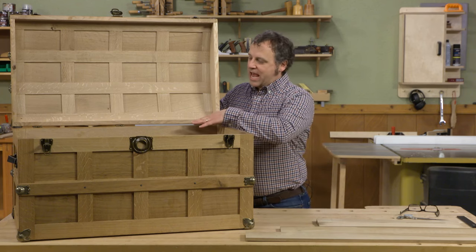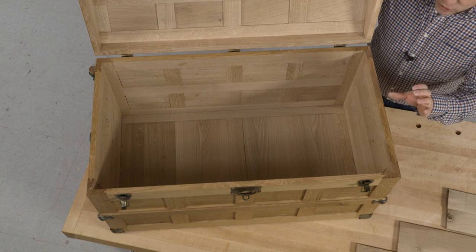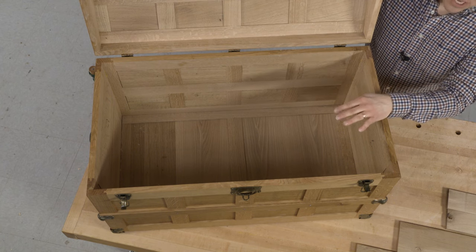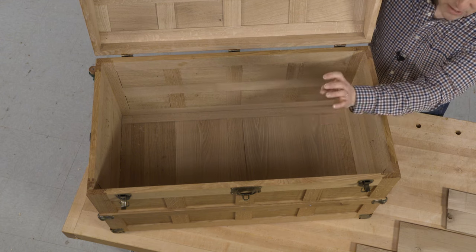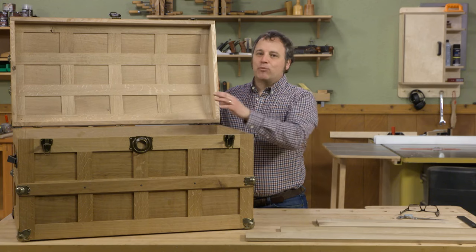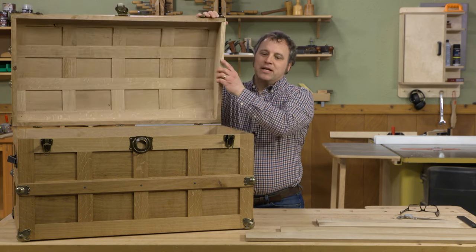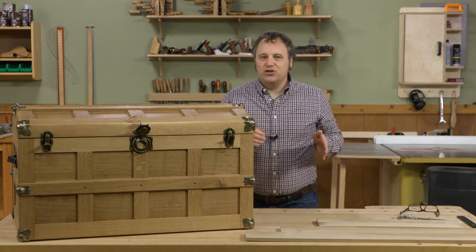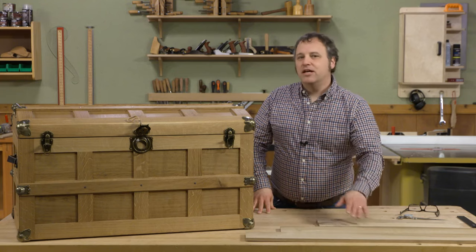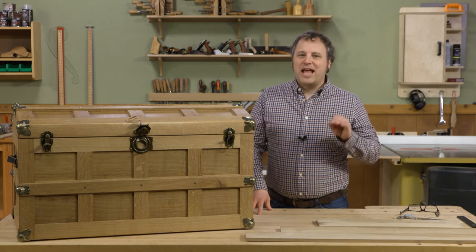Unless we have some kind of organizational system, that's what I'm going to be doing in this video. We're going to add a sliding tray that takes up about half the size of the inside, just a few inches deep, riding on some runners so you can position it anywhere you want. You can keep smaller items in the tray, slide it out of the way to get to stuff below, or pull the tray out entirely for bulky items. First, we'll make cleats for the tray to ride on, using leftover white oak and simple joinery at the table saw.